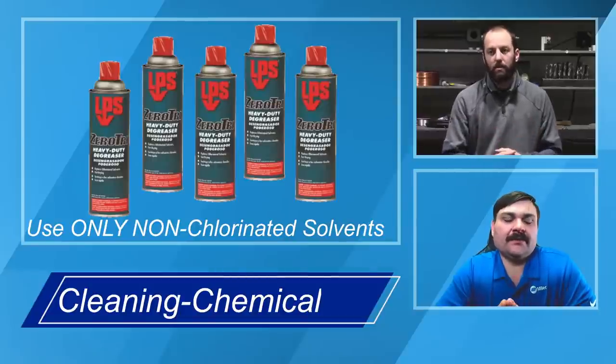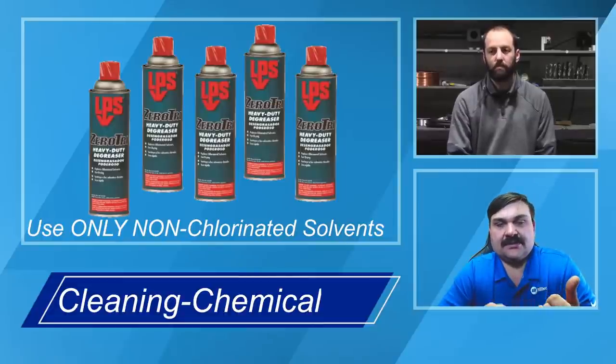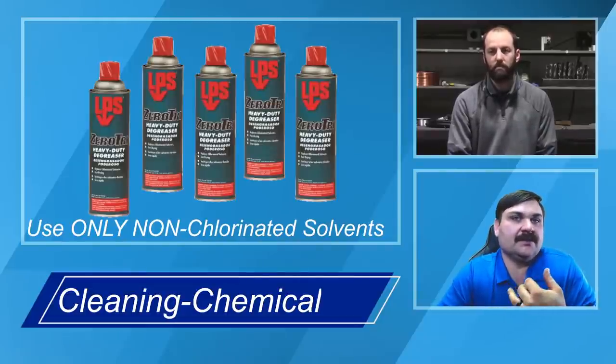And so a couple other good things that you covered right there, real quick before we get into the next one, was your filler material. Whether it's going to be the chemical or mechanical that we're going to talk about a little bit, you need to be cleaning that as well. It's got the oxide layer on it, just like your base material does.